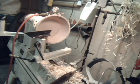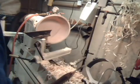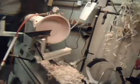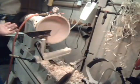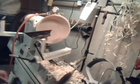Every bowl turner has pretty much their own little quirks and style. Like I said before, Mike Mahoney does nothing but pull cut on the outside of a bowl. That's his thing. Stuart Batty gets over here, he gets the tailstock out of the way, and he does a push cut on the outside of a bowl. That's his thing. They do basically the same thing. Everything on the inside of a bowl is a push cut. But it's just how they get to the finished product. That's their little niche. Every instructor teaches a little bit different.